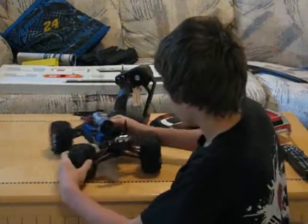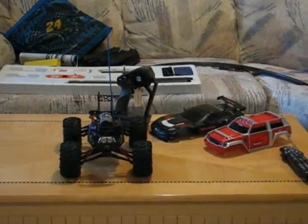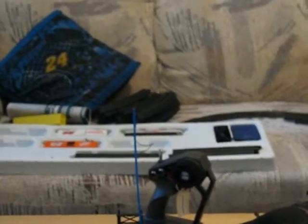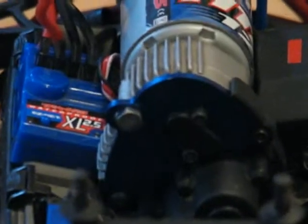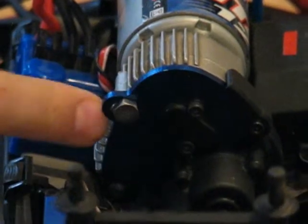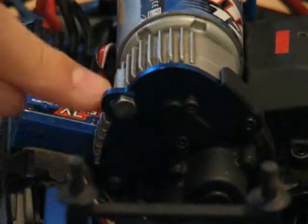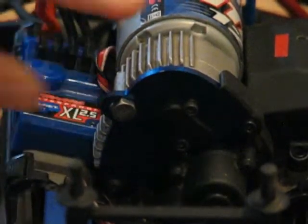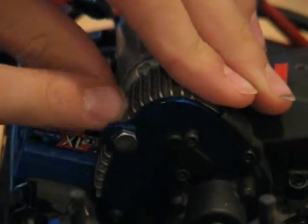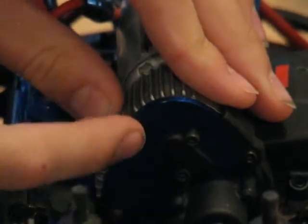On the motor mount here — I'll zoom in again so you guys can see even better. You see that little screw there? Well, that's not the original screw. The motor mount where the screw goes into had been stripped. So I took out the screw, made the hole bigger, put some thread, got a new screw that fit in that hole, and that's nice and sturdy.